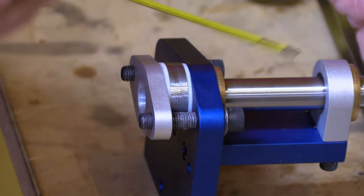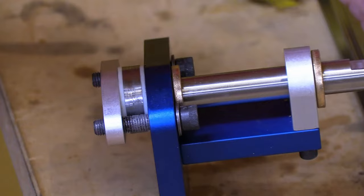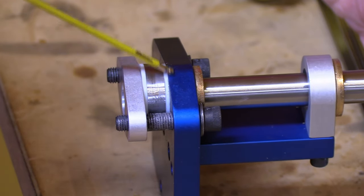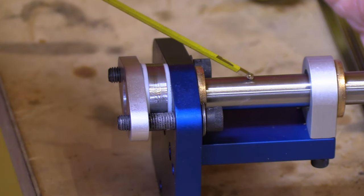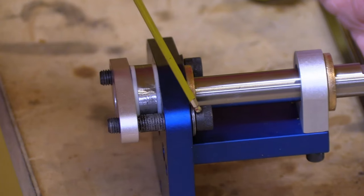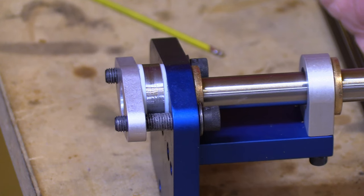I have a ground precision stainless steel shaft going through bronze bushings in a precise assembly, so there shouldn't be much slop. Then there's an aluminum plate, a Teflon washer, a polished steel ring attached to the stainless shaft, another Teflon washer, and another aluminum plate. We have two Belleville washers on each of the adjusting screws, and the adjusting screws are fine pitch — quarter-twenty-eight.